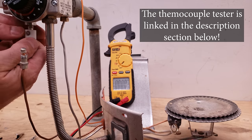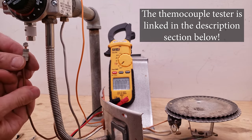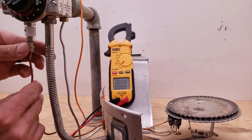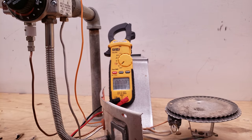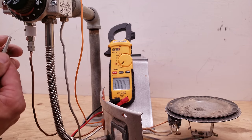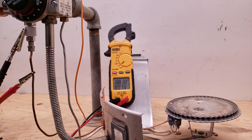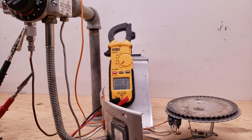First thing you do is screw this in. In our last test, you saw that we were reading millivolts and it was increasing, so we know that thermocouple is actually good. But let's go ahead and measure this — we just need one alligator clip here and one on the wire. Now it's above three. Both my hands are off of it now and it is holding that solenoid in place. I'm going to go ahead and blow out the pilot flame. It should make a clicking noise.